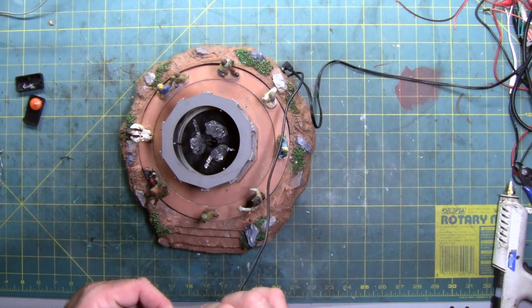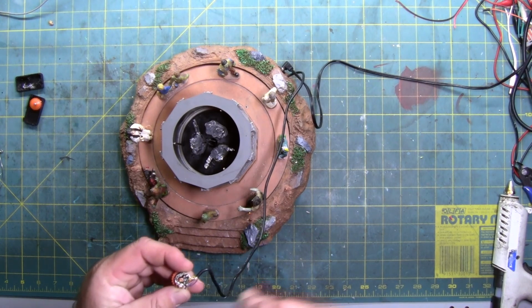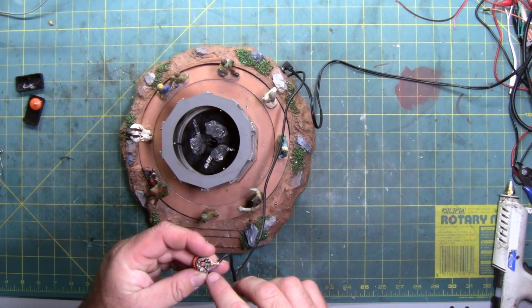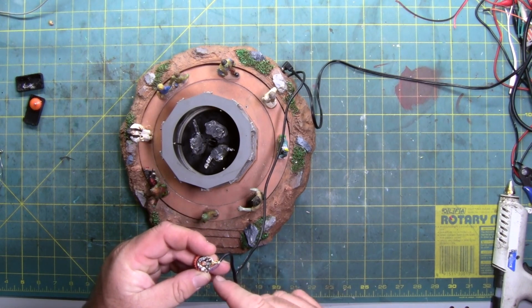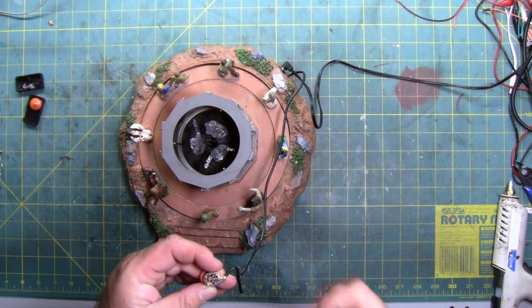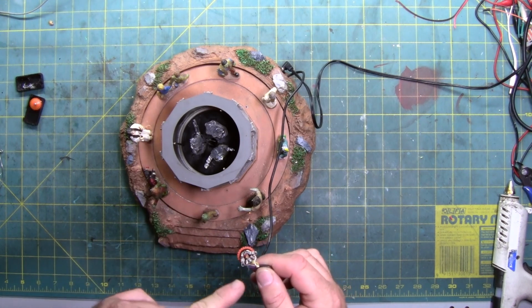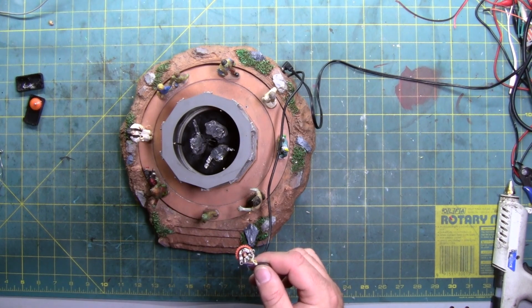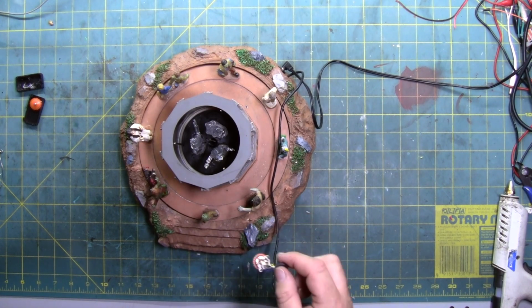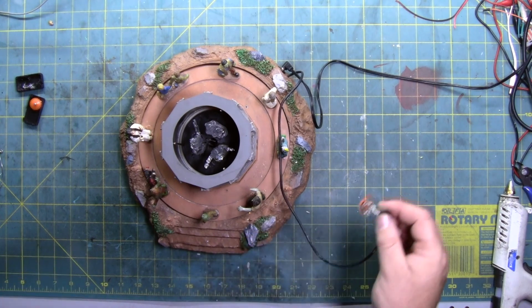Just so you know, the center pin is green. So if you're holding it with the pin facing to your right, it goes incoming power, which is on this one gray, blue, green, yellow, white, outgoing power. Sometimes I've seen them white and pink for the powers, but usually the three wires in the middle are always blue, green, and yellow. And generally they're all in the same order. That other house was the same order. It's just the two power wires were different shades.